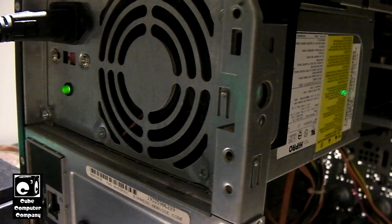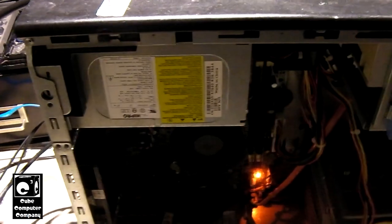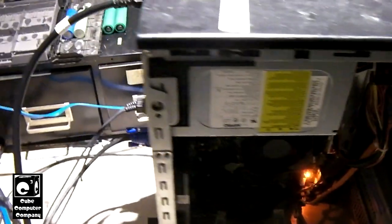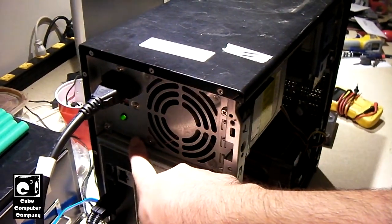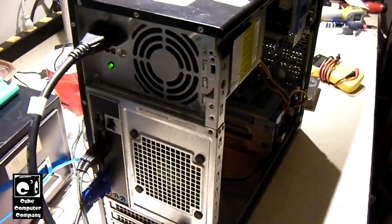It ain't like that FSP unit where it was all over the place. I'm willing to bet it's probably an issue with one of the little capacitors within the vicinity of the supervisory chip, because I think they work in conjunction with it to light up the power good — it's like a logic circuit, it's either on or it's off. The simple fact that there is that little bit of a delay before it starts working properly is a dead-on indicator that it's capacitor-related.